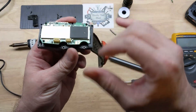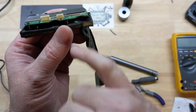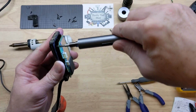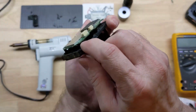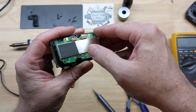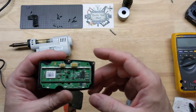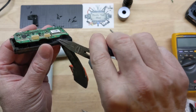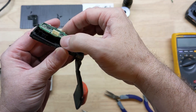I have desoldered the stud that comes through for the radio antenna — that looks like it was keeping us attached to the board. We've got at least three screws here. Looks like we've got another base under this can. And there's our fourth screw right here. And there we go — we've lifted it.